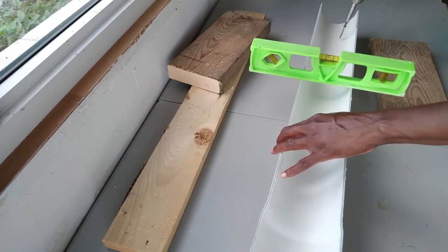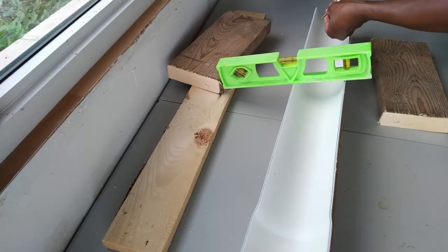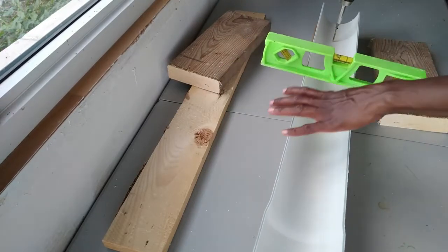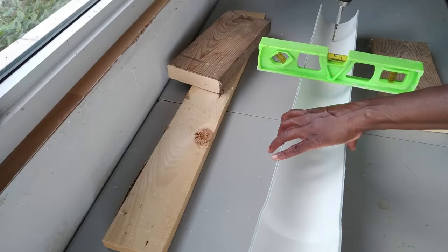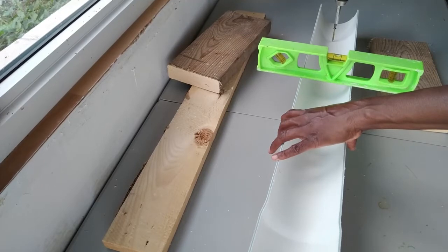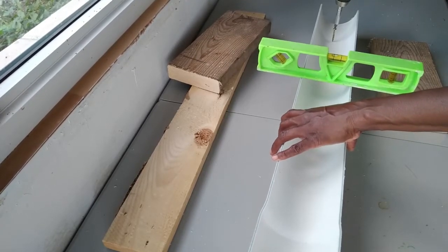If you don't have any six-by-one, you can opt to join two three-by-one pieces together, because this is what you'll use to cover the top of your feeder. You will also need two pieces of two-by-six, each one foot long — these will be your legs. Then you'll need some two-and-a-half inch screws and some one-inch screws.